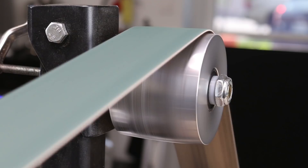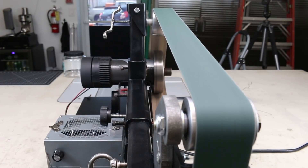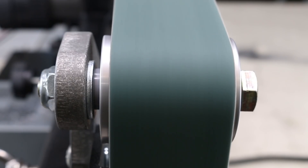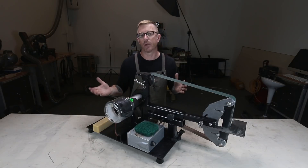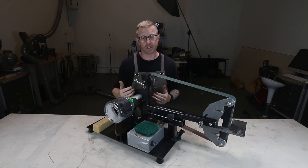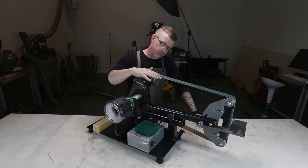I've gotten questions about tracking. I feel like the tracking is pretty good — I get just a slight bit of horizontal wobble on the belt, and I'm not sure if it's the cheap belts I bought on Amazon, a six-pack of 36 grit for like $8–9, or if it's something going on with the tracking. There were a lot of comments about the flywheel not being two inches wide — does that mess with tracking or belts? I haven't seen the belts tweak at all. I used Loctite to hold the flywheel on, so I could swap it out for a proper two-inch drive wheel, though using the flywheel that came on the treadmill motor is the cheaper and easier option.